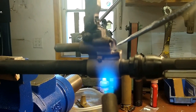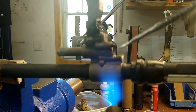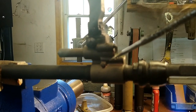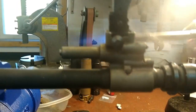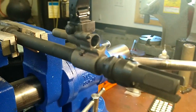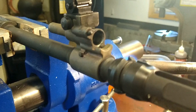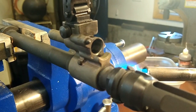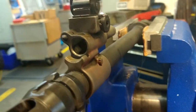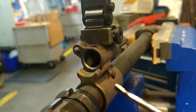It's kind of an oranging of the actual metal — not getting it so hot that it's glowing red, but you can kind of see you're getting this pinkish-reddish color. Now we're going to move to the opposite side of the barrel and do the same thing. So instead of your 7 or 8 o'clock position, we're at the 5 and 3 o'clock — that's the side of the gas block. See the orange in there? See how this is kind of orange now?